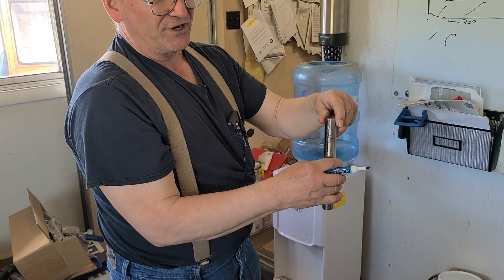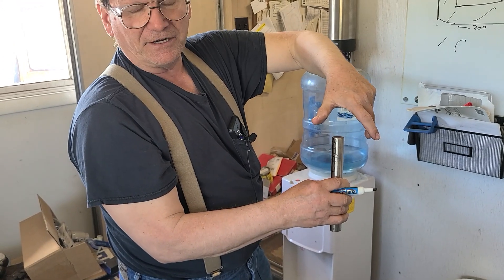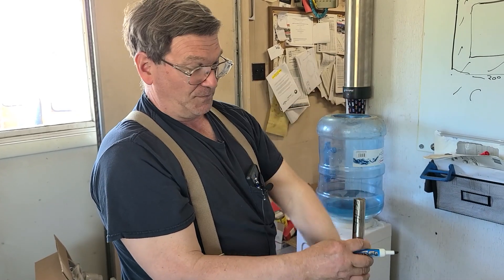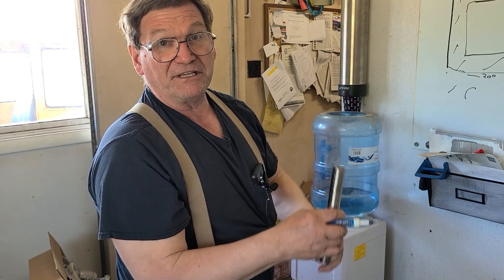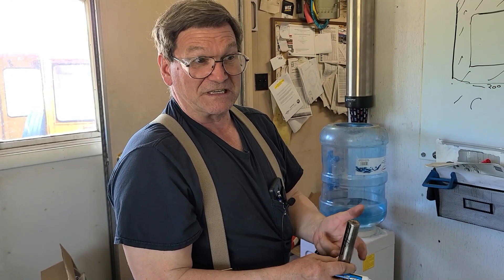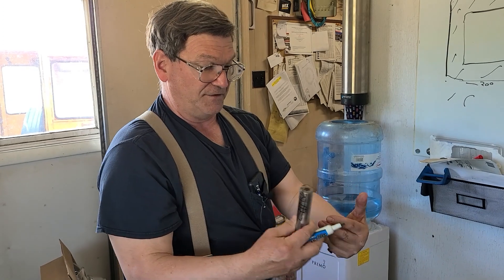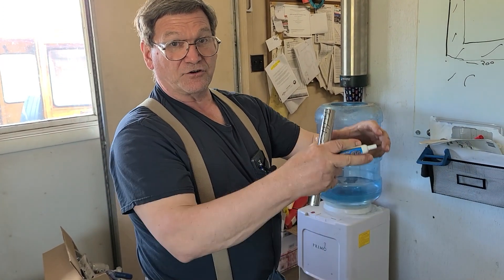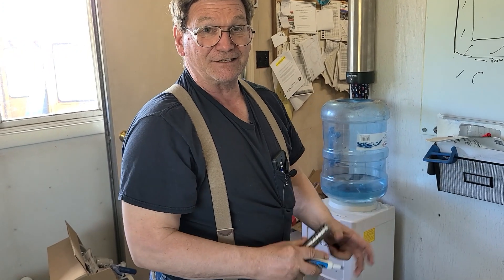You pull this up, and when you get it where you want it for your impeller clearance, the nut will have some bolts and you bolt it so it doesn't turn anymore — the key drives it. Most of these, you'll have them all the way down, then bring them up to where there's a certain tension. You're lifting the impeller at the bottom, then coming up a given amount. On the ones I've worked on, 3/16ths was a pretty common amount to come up. If it's an in-seal pump where the end of the impeller is sealing, you'd probably come closer to 1/16th inch back. What I'm used to are ones with wear rings that do the main sealing, so the 3/16ths gives a little more clearance off the bottom of the casting.